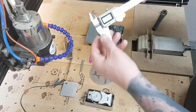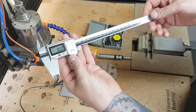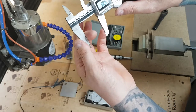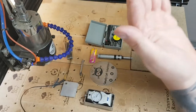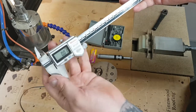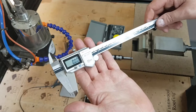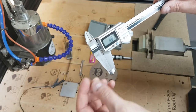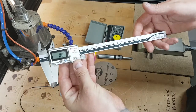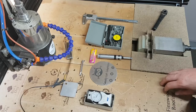Most common for measuring in CNC engineering is your 200 millimeter vernier calipers. They can measure external diameters and dimensions, and you've got your prongs at the top for internal dimensions, and at the end you can measure depths. It's always nice to have a good set of verniers — even if you're just doing woodwork, they're handy for measuring bolt sizes, drill bits, all sorts of things. A cheap set of vernier calipers is better than none.